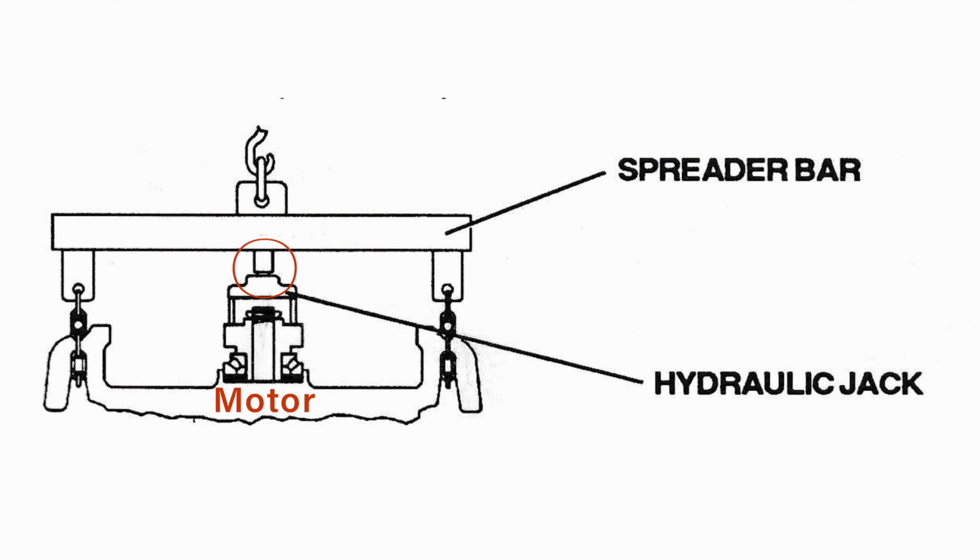Any other questions you guys can think of? Maybe you can explain it a little bit better than I did on why you have to leave the rotor jacked up and only compress the springs. I didn't really go into a full explanation. So when you jack the rotor up against the bearing cap, before you even have any hydraulic pressures on the top end, the rotor's up against the bearing cap, so we know that this bearing is now setting here solid. So now all we're dealing with is the upper bearing setting the gap in it, because when we release the jack on the bottom, the bearing is going to be sitting where this 10 thousandths is at, and those springs are going to pull up.